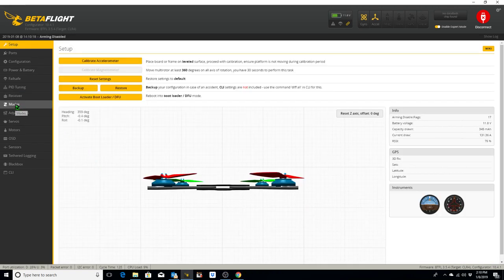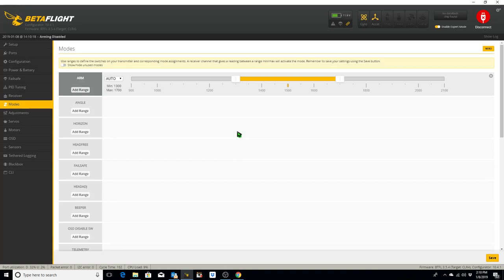Okay, now we're going to go to our modes tab and we're going to set up arm. And I've already set it up on my transmitter. When I flip the switch, two position switch, watch this blip. It goes over here. So I want to make sure that this bar is over that. So it's unarmed, armed. I'm going to click save,